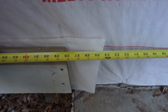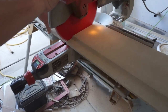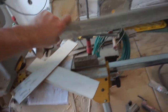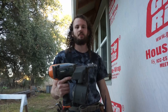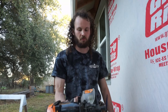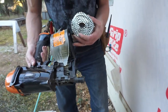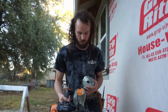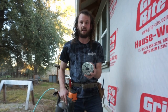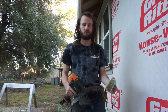We're getting ready to cut this piece, first taking a measurement. The nice thing about this material is that it will cut with common construction tools like skill saws — however, it will wear out the blade. This is a coil nail gun, like a roofing nail gun, except we're using siding nails. Unlike a roofing nail gun which only shoots up to inch-and-a-half length, these can go up to two-and-a-half inch length with a much smaller head — easier to finish and really convenient for siding.